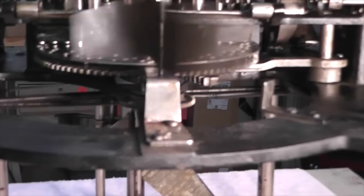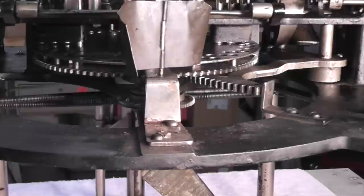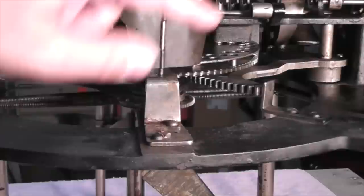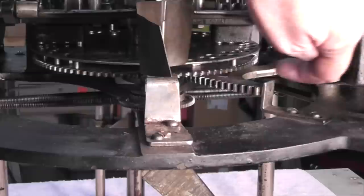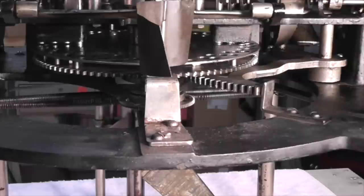And as you can see, the gear that's connected to the springs, which runs the clock and everything, is this guy right here, and it came back to rest against that bracket, which is the bracket that's used to cheat the customer by 10 cents. If that bracket were moved over further to the left by a quarter inch or so, it'd pay out 10 cents short.